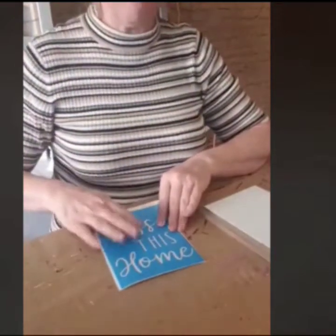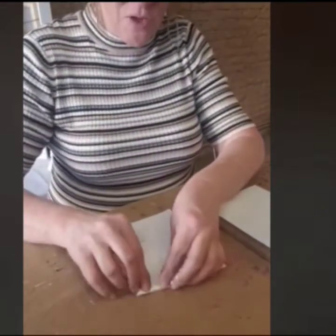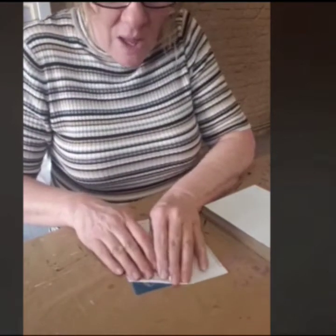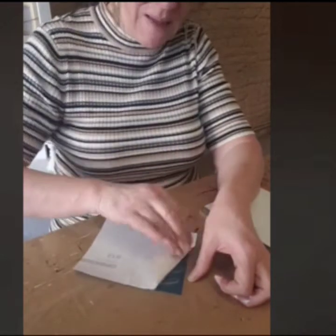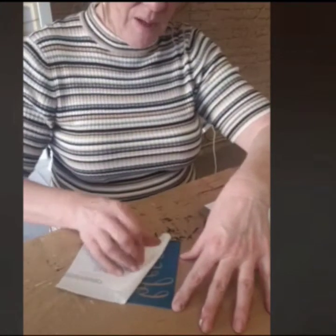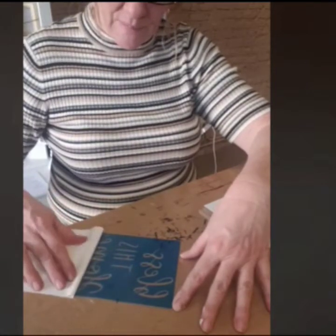Now the board is dry. Instead of putting the stencil face up, we want to put it face down, and when we peel we want to leave the clear and blue layers behind. I peel very slowly, pressing against itself — folding it back on itself — rather than just pulling up. The reason I do that is all those little centers will peel up if I don't do it this way. Pull all the way down until the paper is completely off.